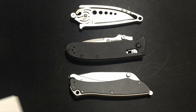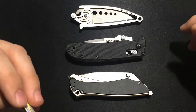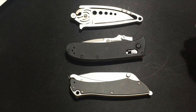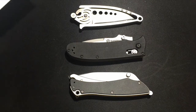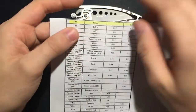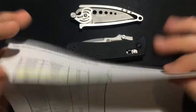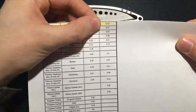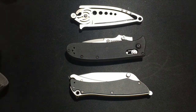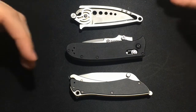While we're talking about washers, let's take a look at nylon. Nylon was extremely hard to find results for because it's not used as often in a washer format. Looking at this from MechGuru — steel on nylon, since most of the time it's nylon on nylon, that's why it's so hard to find — we see a 0.35. So essentially, a nylon washer versus a bronze washer, you're getting that same coefficient of friction. It's not going to make a difference as far as friction goes.